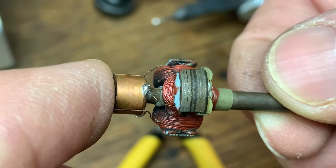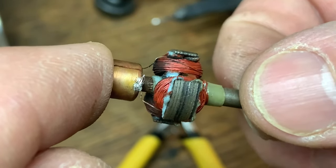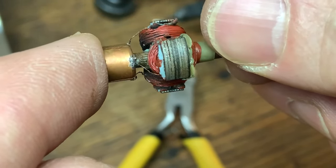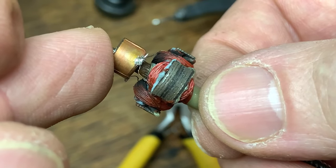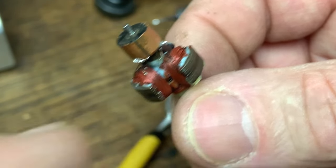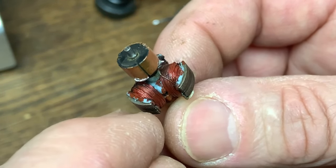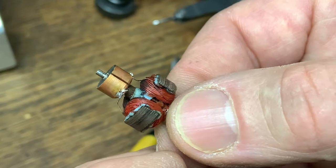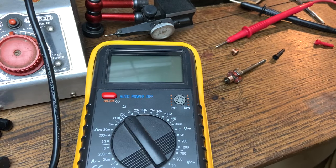I'll show you exactly how it looks - they're good solder joints. I'll pop it in the lathe and just tidy it up, spin it around and clean up the excess to make it look a little more professional. I didn't want to get too much heat in because the wire is very thin and it's already been undone once. There's a splash of solder just on the windings there - I've done my best to be tidy. I'll give it a bit of a tidy up and then take some resistance readings and build the motor back up.